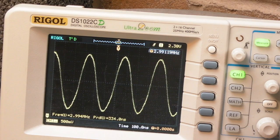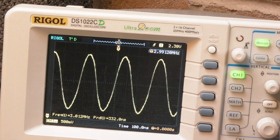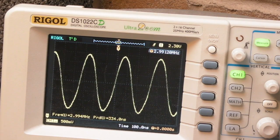Had I noticed that at that time, then I would have been like, I think we need those 2 caps on there. Well, I wouldn't have said that straight away. I would have looked at it and gone, oh, it's not got any caps on the crystal. It really should have them. And then I may have looked at the other PCB, a later rev, and noticed that the later versions did have the caps there. I still don't understand why we had to do this. It must have had a different chip on it at some point that, for whatever reason, didn't need those caps.